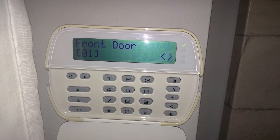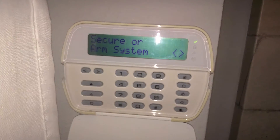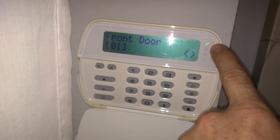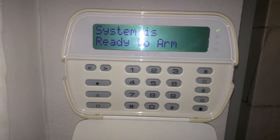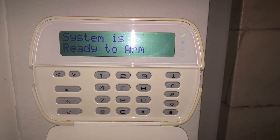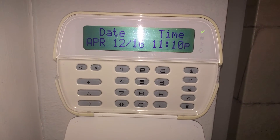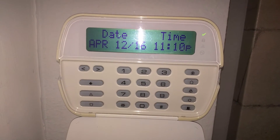In order to allow you to still see which zones are open, you can set the keypad to automatically scroll through the list of all the open zones when there are any zones open. So instead of looking for the green check mark, you're going to look to make sure that the system is not scrolling through zones. When all of the zones are closed, it will either show the date and time, or it will say that the system is ready to arm. If you just walked by your motion detector, it might still show the motion detector as being active, and that's not a problem. This is the only way to really have the ability to remotely arm your system without fail every time, even if you forget and leave a window open or a door cracked.